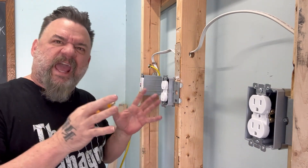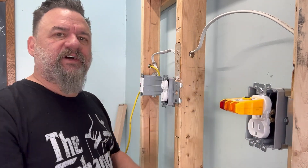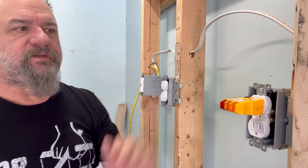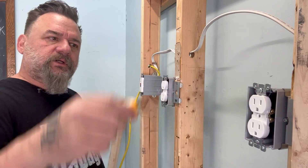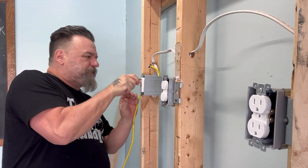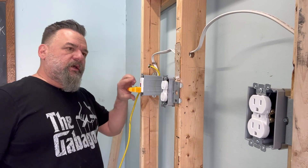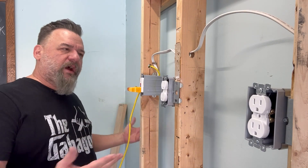So let's say we want to add to a plug or whatever — we want to find those plugs in that GFI circuit. You can't really see the lights there, but it says it's wired correctly. Hit the button — GFI tripped. So you go through. You know that one's off, that one's off, that one's off. But do we really know if there's power in these?